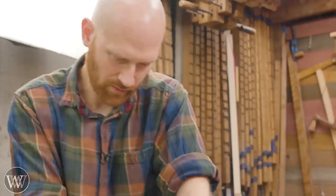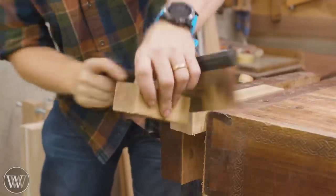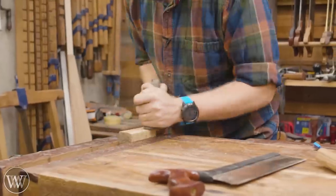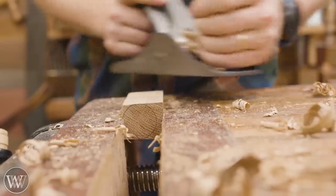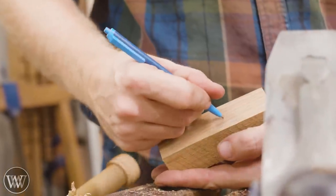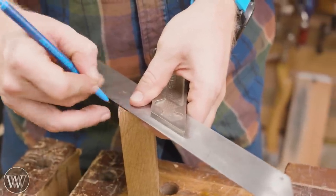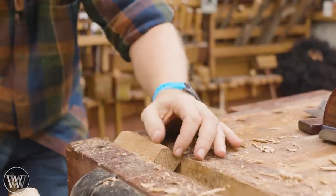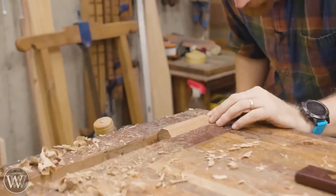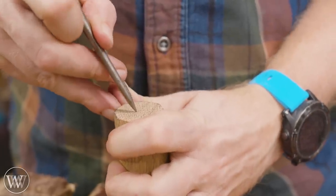Now we need to work on the handle, and I'm going to be making mine out of a chunk of red oak I had lying around. It's about an inch and a half by inch and a half block that I can shape down into the handle I want. I want to keep it octagonal — to do an octagon, draw a circle and plane that circle down into a square where all the square sides just touch the circle. Then put corner lines connecting to the outside of the circle on the corners, giving you your eight-sided octagon with all eight sides equal. Put it back in a vise and plane down those sides. It only took about five or six minutes from block to this point.